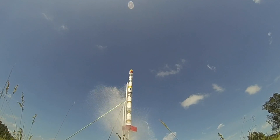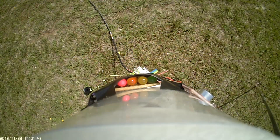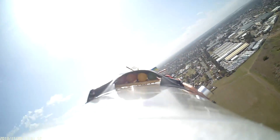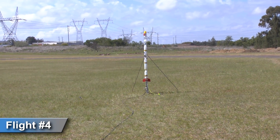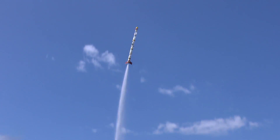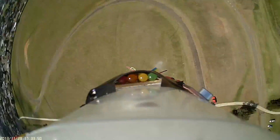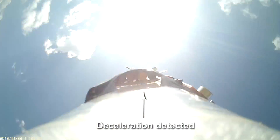We tried that again and again the circuit looked like it worked as expected. We decided to give it one more go — three, two, one, go! It's squirrelly! As we can see from the LEDs, this time the circuit failed to detect the acceleration after apogee. It did detect the initial acceleration and deceleration, but not the final positive slope needed to trigger deployment.